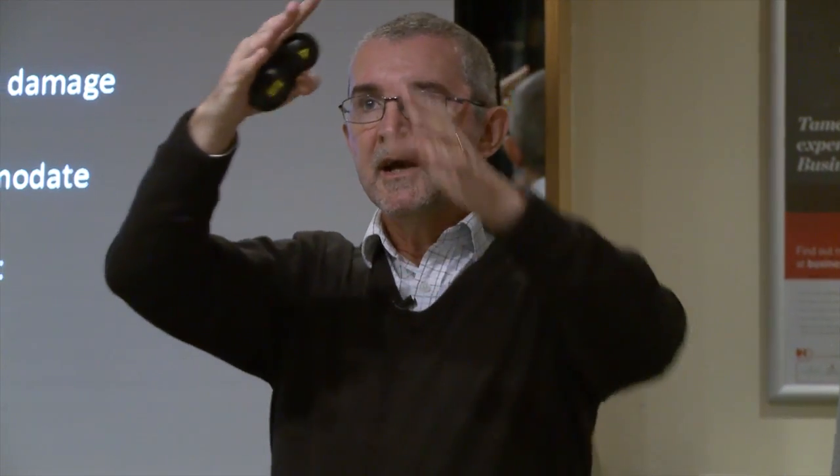Sometimes you go into an old building, you've got a lath and plaster ceiling and it's all cracked, maybe even loose, so you can put your hand on it and you can move it. You can reuse these. It's almost like the ultimate in recycling. Drop the ceiling, or if it falls down anyway and it's all over someone's floor, as long as it hasn't got wallpaper on it, it can have multiple layers of paint, and also as long as it hasn't got gypsum plaster on it.